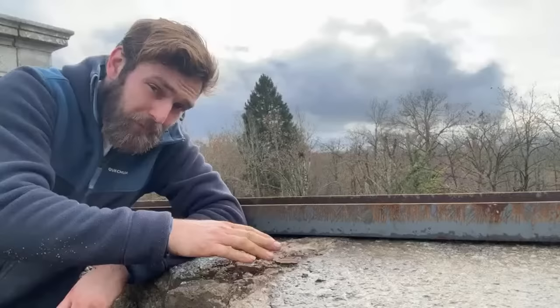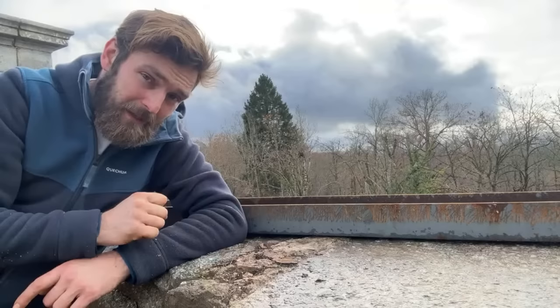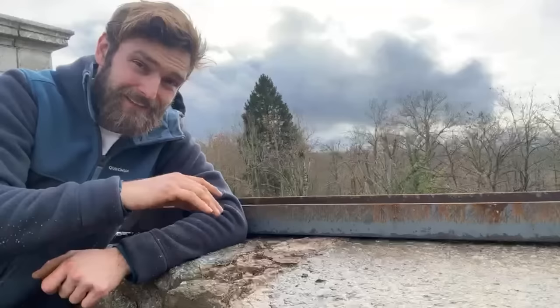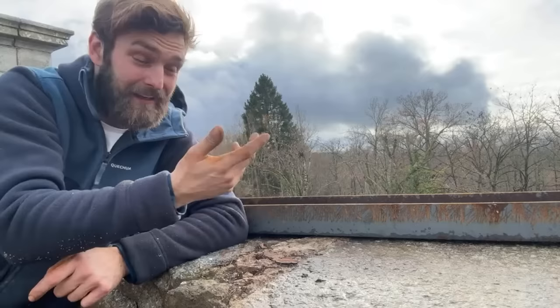Up on here, plaster. That's actually originally how they did it. That's what was scraping off the top of the walls. It was all plaster just to get a level. So I'm going to do that, let it set, and then I can bring the beams on. And hopefully the idea is that the roof is going to be super level, and it means it's going to go on quicker because I can cut everything to the same size, knowing that it's all going to fit rather than edit each one, as they probably would have had to do originally. It would have been a lot more time-consuming.